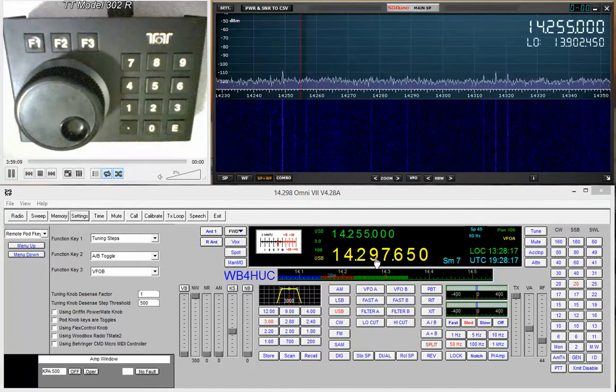For my use I wouldn't use that so much for split DX operating, but maybe if I was tuned to a frequency waiting for a schedule, I could tune around the band with the other receiver. Or if you're waiting for a net to start you can tune around the band a little with the other receiver. Automatically, when you're using one of these external receivers that the N4PY software is talking to, as soon as you go into split mode VFOB controls that other receiver.